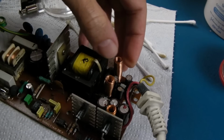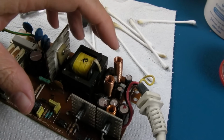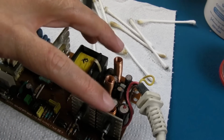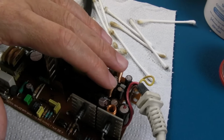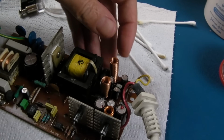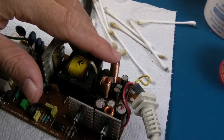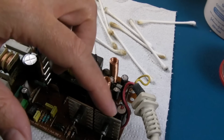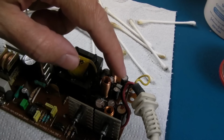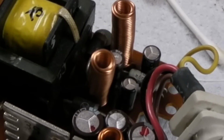I think what I'm going to do is just get some tubes of heat shrink and shrink them down a bit. And you could think that's a bad idea, but you know what? Inductors are often just encapsulated in plastic anyway. The stress that these are under is not immense. These aren't going to get hot, but I would feel happier knowing that these aren't going to spring around with slight vibrations and knocks, because the heat shrink will hold them, but also it's not going to short here. I mean, look at that, that's ridiculous. What effect is that on your power supply line when that happens, when you knock it with your foot under the table when it's running?